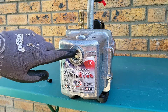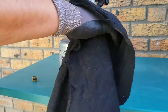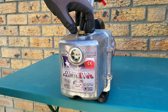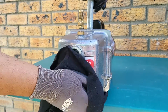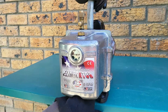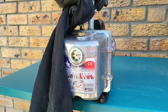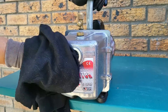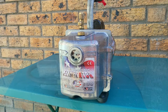As you can see, the oil level is now right exactly where we wanted — right on the oil mark on the pump. I'm quite happy that it's full and the plug is closed at the bottom. We're going to close her up now and get her ready to run another vacuum test. We're happy that the oil level is exactly what it has to be and we've closed all the caps, so let's go ahead and get her attached to the rig so we can start a new vacuum test.